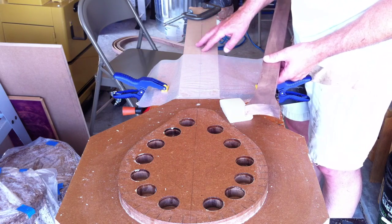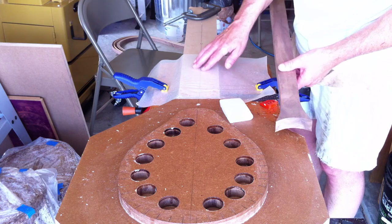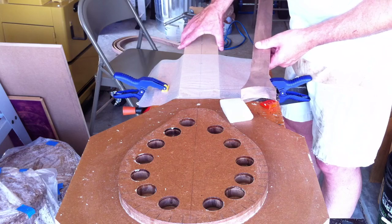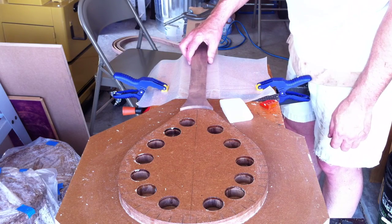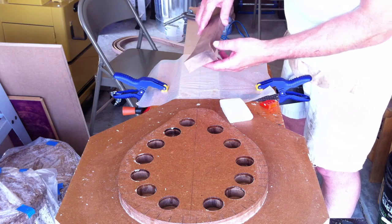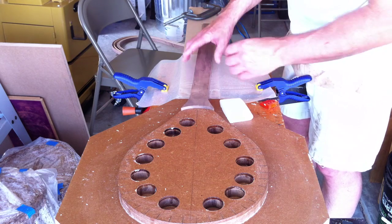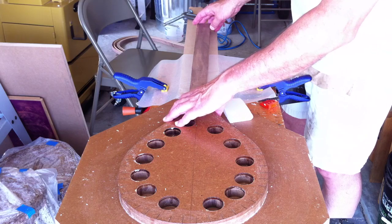Since this extension isn't finished or doesn't have any wax on it, I put a piece of wax paper over it here to keep us from gluing our handle to the jig. After I cut the handle, I went ahead to the drum sander and cleaned up all these edges on the inside and cleaned down the sides about to where the outside bends are going to go.